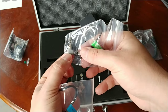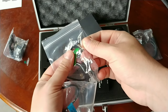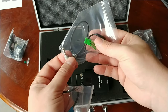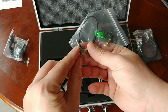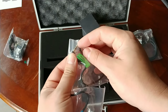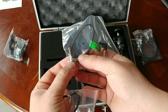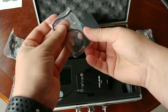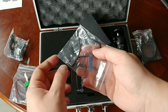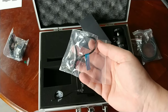They've gotten in the habit of coloring the end gray on all the things that attach to your cell phone, so basically this will go from your receiver to your cell phone — that's what will transmit the audio through the receiver to your phone. This is a TRRS cable — tip, ring, ring, sleeve. And this is a TRS — tip, ring, sleeve. So you need a TRRS to go into your phone. This other cable is for your DSLR or external recorder, and that's a TRS to TRS cable. So you get the adapter for your phone and then a straight-up TRS to TRS.